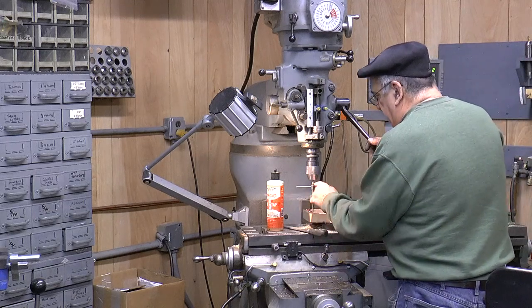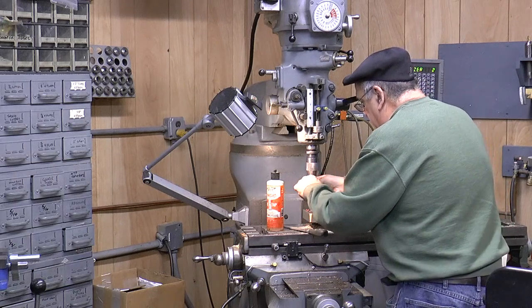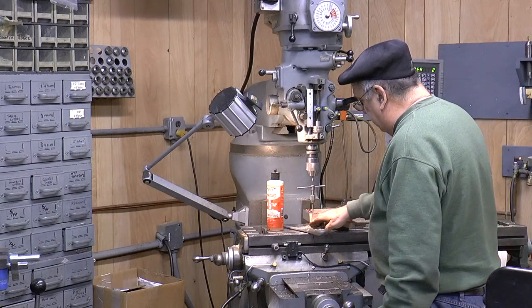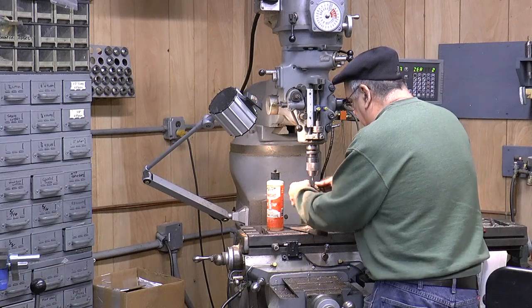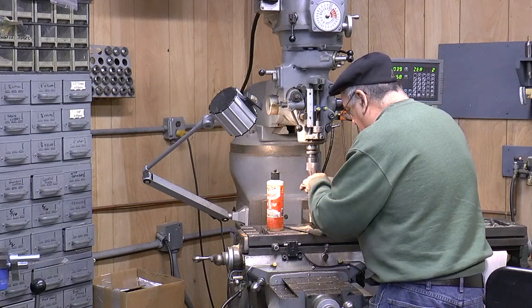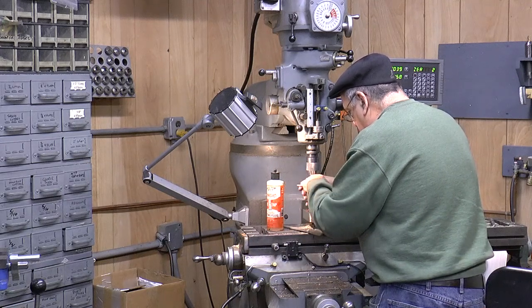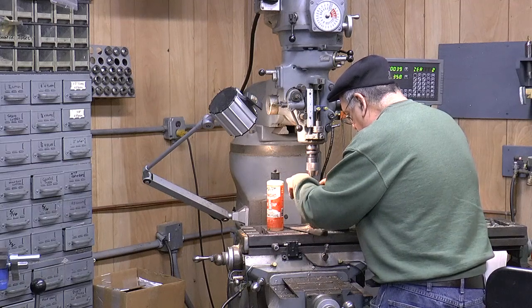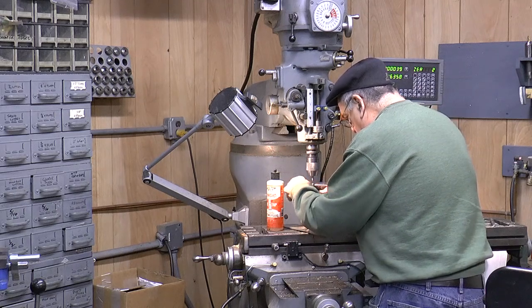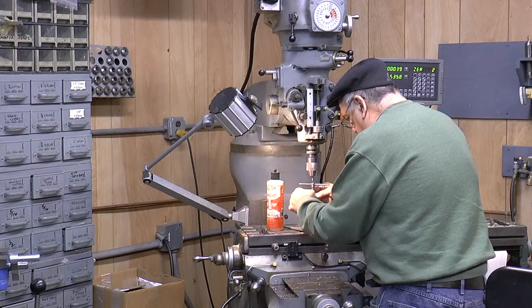The point is that you use a center here. Now this thing is not level, so you can't use it on that surface there. Tap it, so you got to do them by hand. Of course, this is the last operation. You don't have to be all the way down because there's only three little short screws. And I use the center in here. There's a little center in the tapping wrench, and it goes in real easy.